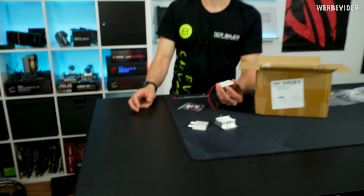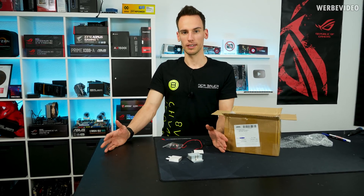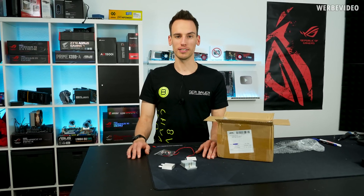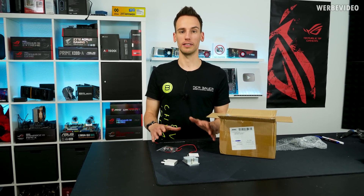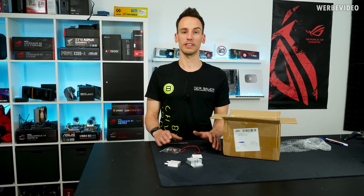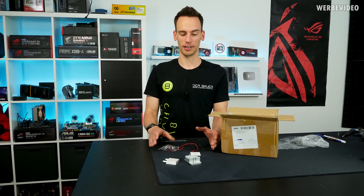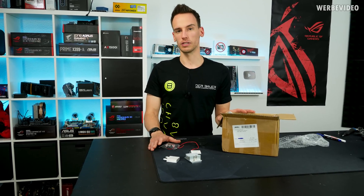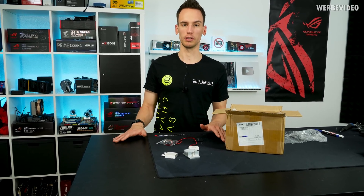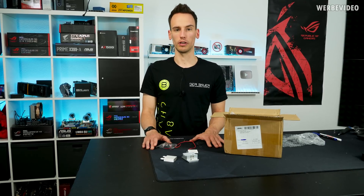12 times 60 watts should be capable of cooling down some water quite a bit. We will assemble all 12 sets on one plate and see if we can make a DIY chiller this way. This is a much cheaper solution than professional chillers that use phase change cooling like a refrigerator - those are more efficient and have better cooling, but also much more expensive. With 720 watts of power consumption it's quite a lot, but the purchase price is much lower. Just those 12 sets cost about $200, which is quite affordable, and the whole chiller including tubing and the base plate should come in below $300.